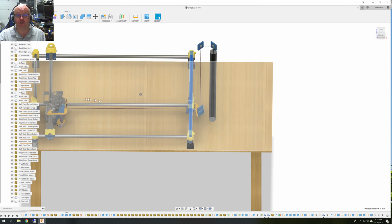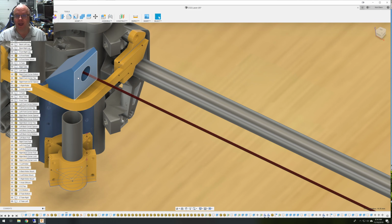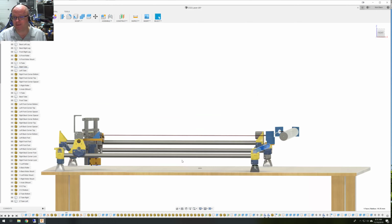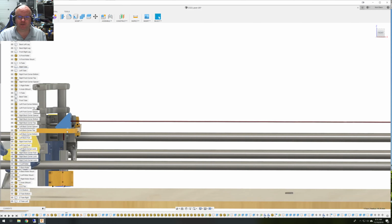And then you start from this mirror and you work towards this mirror. This mirror has a very nice flat surface, so it's a little easier to put a piece of tape across here and find out where the same point is, by moving it from one side of the X to the other, the laser beam doesn't move. And when I wanted to make this mirror here, which is mirror 2, flush with mirror 3, that was the easy part, because doing it this way, I built the mounting arrangements with them already parallel. I mean, I drew them in Fusion perfectly parallel. The 2 discs spot on, because I'm drawing them, so I can apply the collinear and whatnot restrictions that make them perfect. And then I built the mounts around them. So I already had the mirrors perfectly aligned.